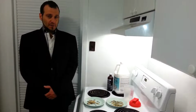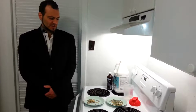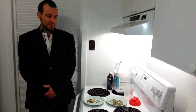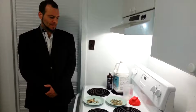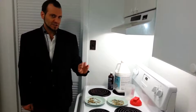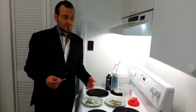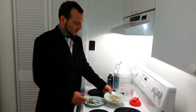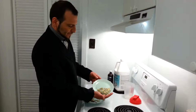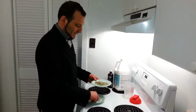We are doing another video in my electronic computer and cell phone recovery series. We're basically going to be recovering the gold, which is 24 karat gold, 0.5 micron inches thick, off of this copper plated stuff. Now this stuff happens to be the edges or the connecting pieces, as they say in slang, fingerboards or fingers. Now these fingers, if you take a look closely, without me losing any, are pretty much 24 karat gold, which is electroplated very heavily onto this green stuff, which happens to be copper.